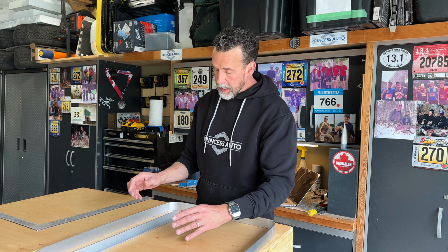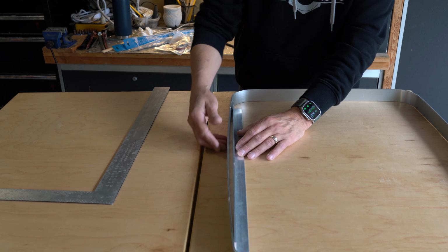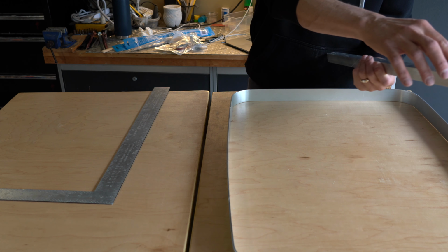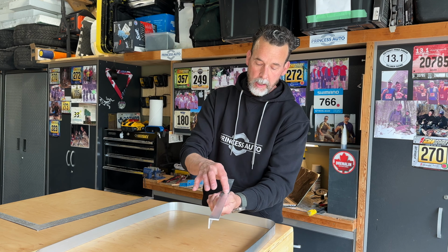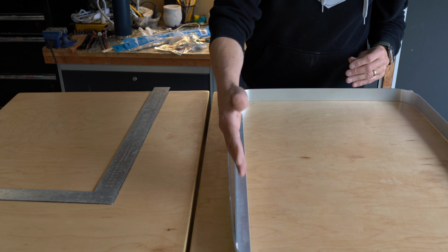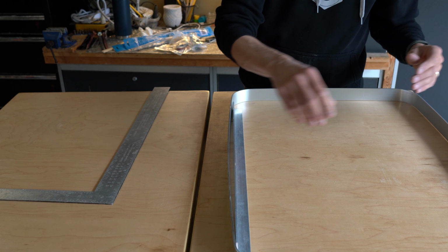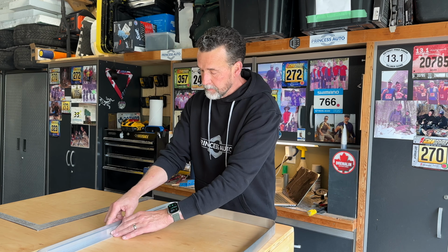So we have this 90-degree piece of angled aluminum, and it's about 23 inches long. As you can see here, there's a bow because the bent aluminum wants to bow out. So what I'm going to do is put some VHB tape on this one side of it, and then we're going to clamp that onto there and leave it like that. That will ensure that we have a perfectly straight edge on that side, and then we're going to do the same on all 4 sides.